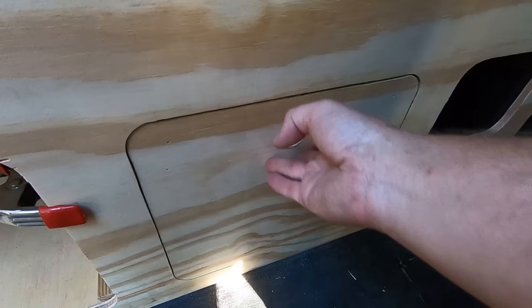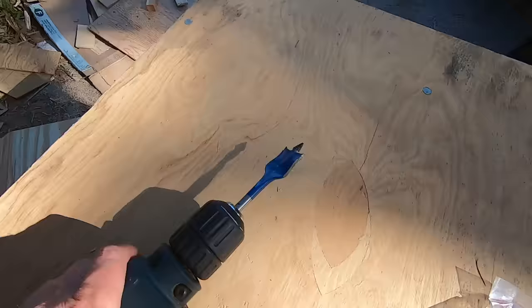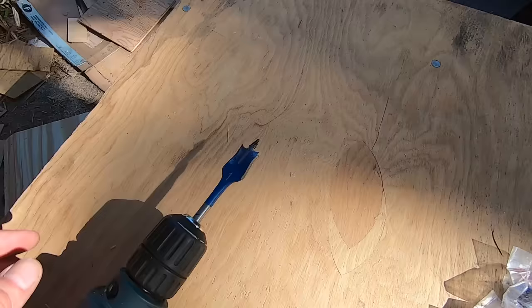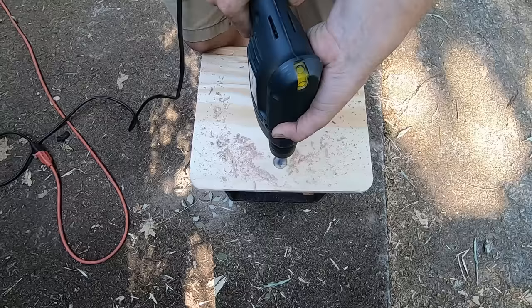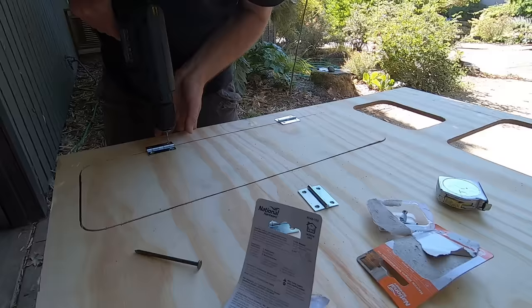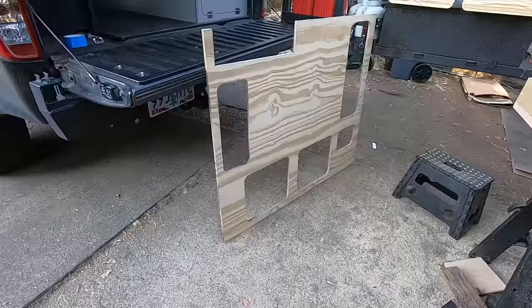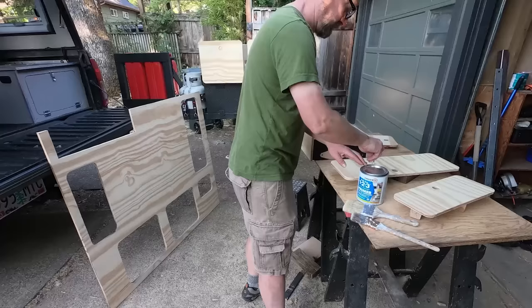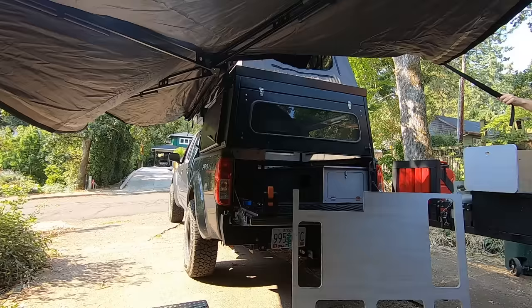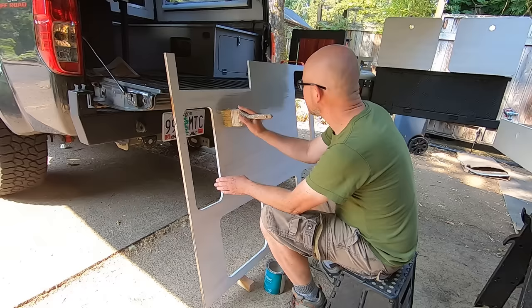Looking pretty good — we'll have to see if the magnets are strong enough to keep the drawers in. To drill the hole for the pull I'm using a one-inch spade bit. This is a little rough through the plywood but I don't want to buy more hardware — I just have to do a little sanding to clean those holes up. The holes were pretty rough but after sanding they cleaned up nicer than I expected. I'm pre-fitting the hardware so I can correct any errors and don't scuff up the finished paint — I'll take the hardware back off before painting. Finally everything is done and ready for paint; I'm starting off with a coat of primer. Primer is dry and it's time for the first coat of paint. Tomorrow I'll do a second coat and then let it cure for a day or two before the final install.